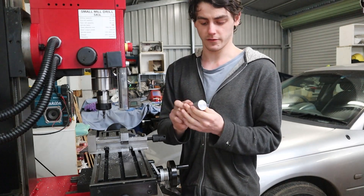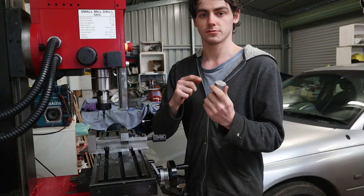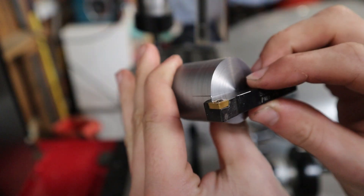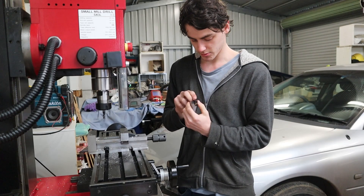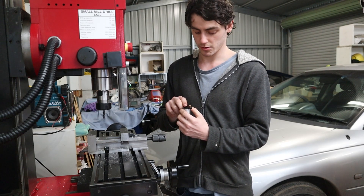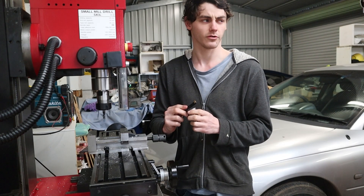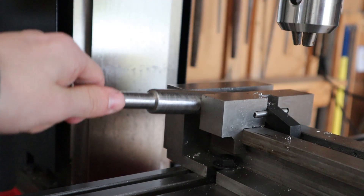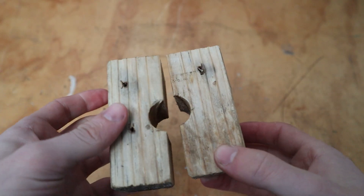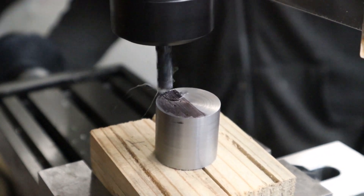I've taken the part off the lathe now. Before I did, I scratched a centre line across the faces so we know where the centre is, because the tool tip needs to be on centre. If the tip's on centre, it means I have to mill on that side of the line and then it will be on a bit of an angle. Holding round material in a vise doesn't really work too well, so Dad was nice enough to make me these little wooden blocks so I could hold the part more securely. I put the blocks in the vise and then rotated the part to about a 5-degree angle.